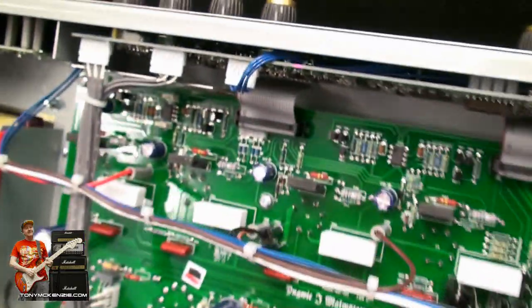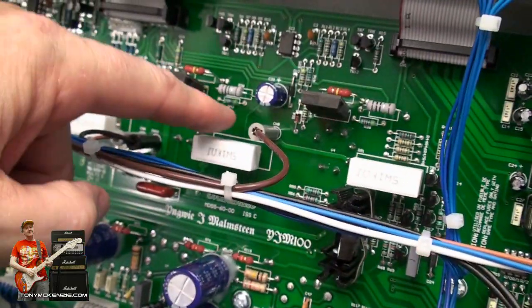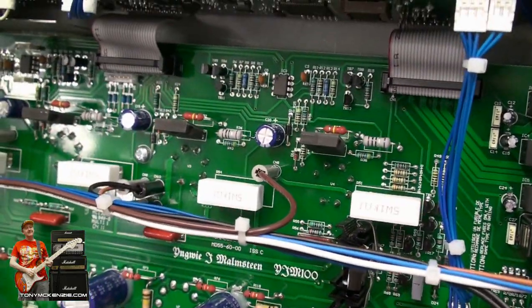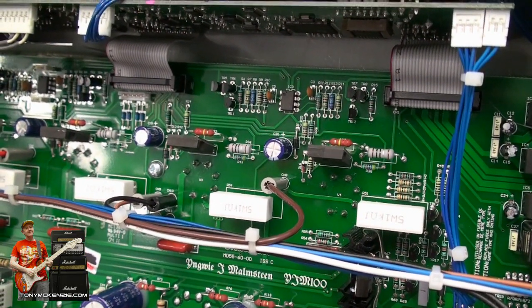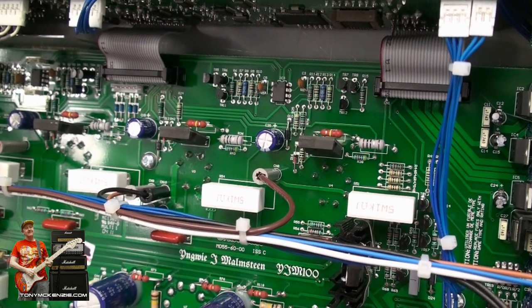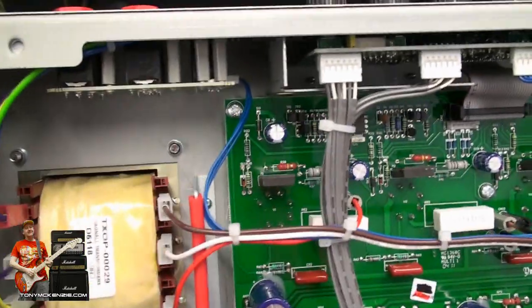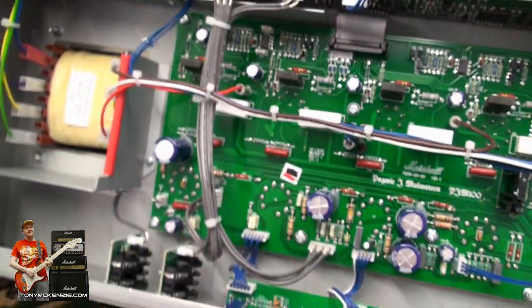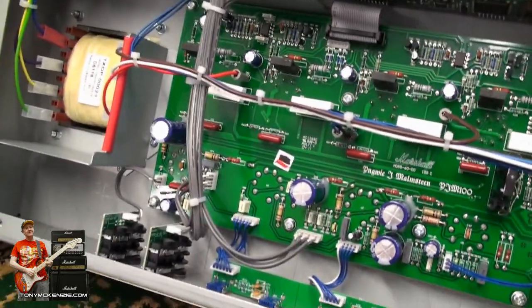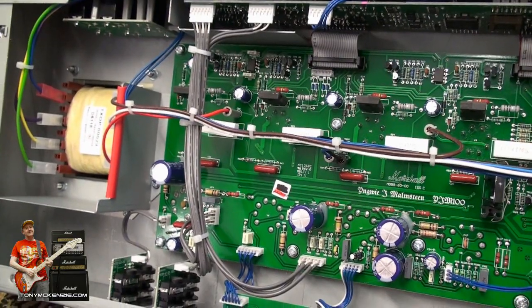The other thing was, like I said earlier, these things down here were touching. And then you had some of these others here all bent over and thrown around. I'm sure that electrically, for the most part, it was okay. But surely, if you mark on the PCB where the resistor should be, having it bent an inch out of the way doesn't help. And absolutely, down there, where the two were touching, that definitely doesn't help. Where's the QC in that? But then again, maybe this was just one of the rush jobs. Well, it can't be a rush job. I've been waiting for months.